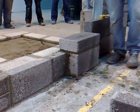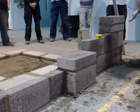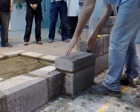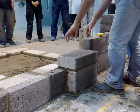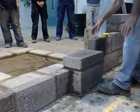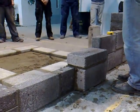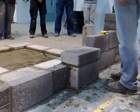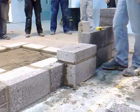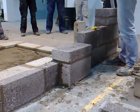If you were running this in on the wall, you have your line set up here running down this way. If you put the next block on top of that one straight away, it could interfere with the line. So your best bet is to put just the bottom one on, run the other blocks along it. Then when you're done building with the line, you just drop your line and tie the block on top of that. That's just showing you how you tie it in, if you ever do a job like that. It's very seldom you'll get someone to build a wall about that length, so if you're doing anything a bit longer, that's how you put your pier in.